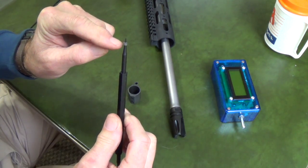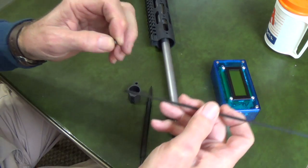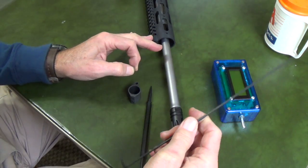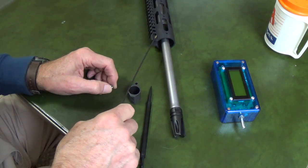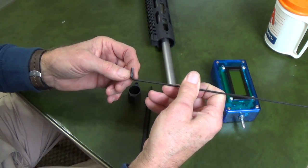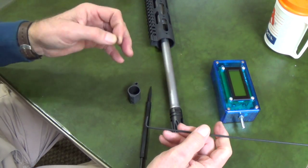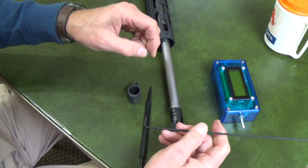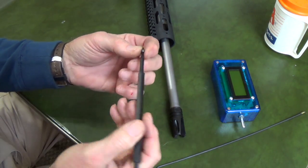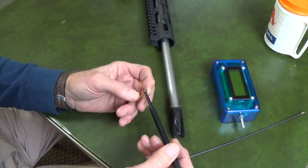The tip has come through — this thing is just hollow. There is no end cap on this. So when you put it on an allen wrench — I'm going to use a short end, I'll show you why in just a minute — this thing simply slides down it. Now imagine I've got my gas block set screw set to where I want it and I'm going to try to put this back in there with it sliding up the allen wrench. That's just not going to work. My guess is the reason this is open on both ends is that if they had it closed like a normal set screw, it must cause problems when it tightens down on the gas-regulating set screw.